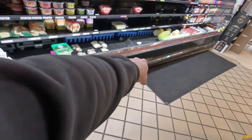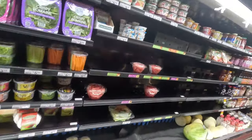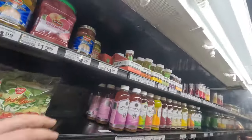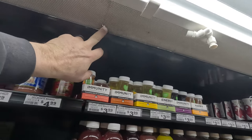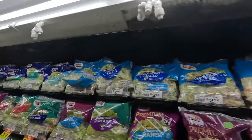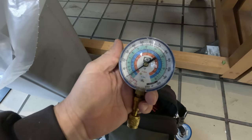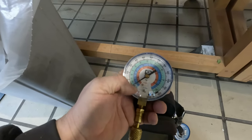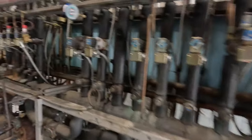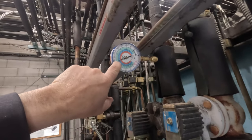So if you look at this, this is one, two, and that one's the third one. That means we've got three temperature sensors in here, which I've seen. There was one up in here. I know I've got one over here, then I had a couple others over there. We're going to grab our JB gauge here, which goes up to 120 — gives me a nice accurate measurement down into the one-pound range, which is what I prefer. Believe it or not, I actually find this to be kind of fun, something new to me — newer. For a 50-pound suction.